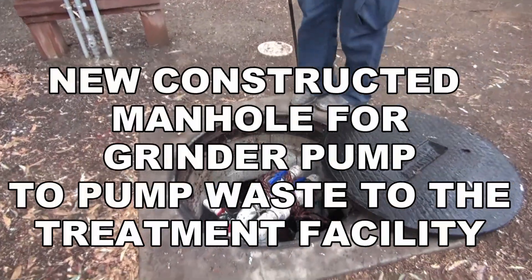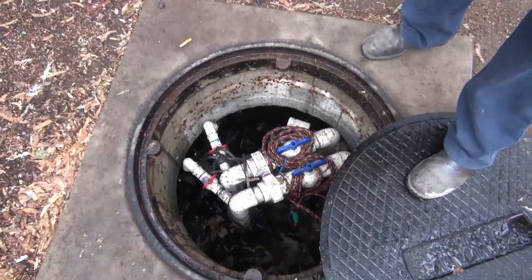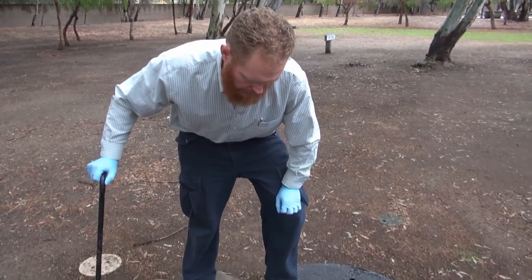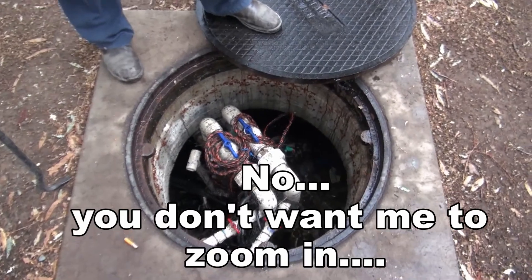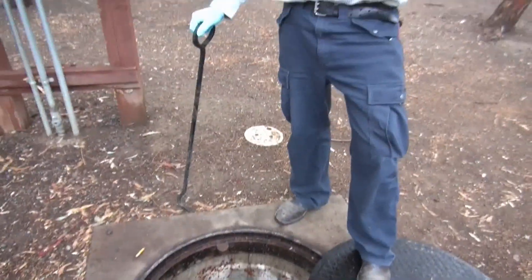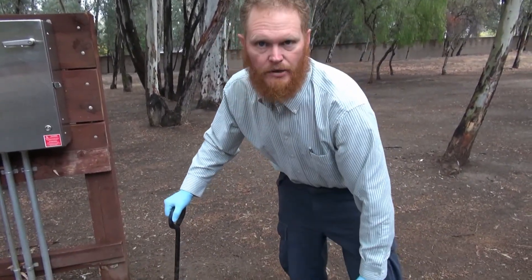This is raw sewage from the building. You can see what we have is a lot of trash that people throw down the drains — rubber gloves, diapers, and all kinds of plastic trash. That's really problematic. This is one of the challenges with wastewater from comfort stations: people use it like a waste disposal system and throw whatever they want in there. So we have to have really good grinder pumps to be able to manage that material.